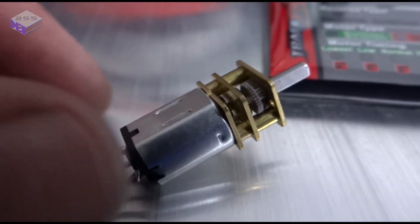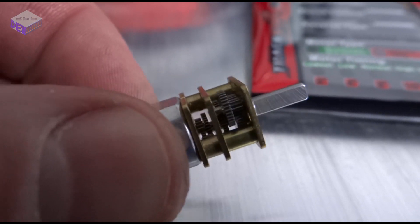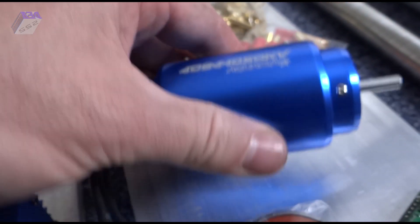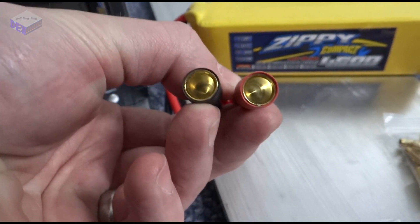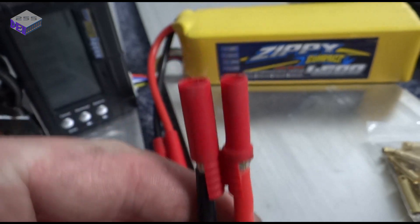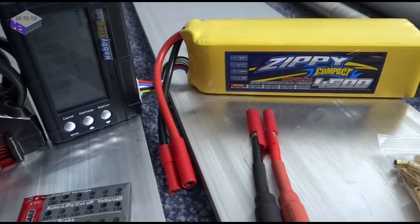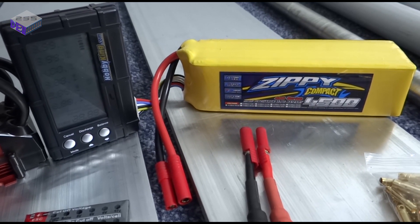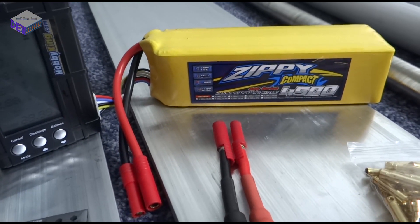This small motor here is mostly metal gear and it's got a hell of a lot of power on its output shaft — I think it's about 6mm. It's got more than enough power to lift the motor off the main gear when disengaging. Regarding the battery, I've had to make a small adapter — I've got 8mm connections on there and the standard connections. The battery is more than capable of supplying 40 times 4.5 amps, which is about 180 amps.